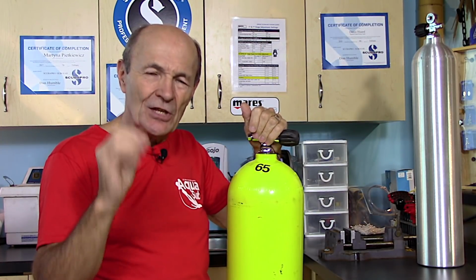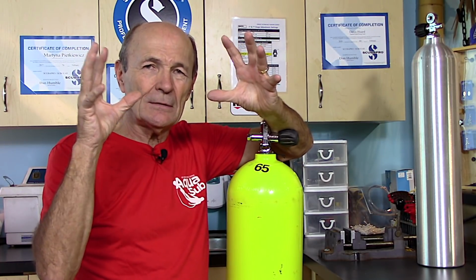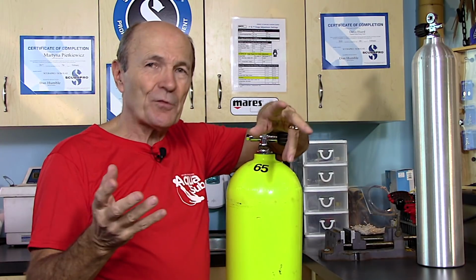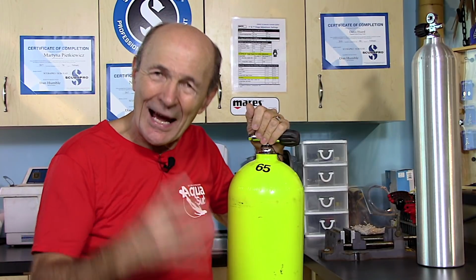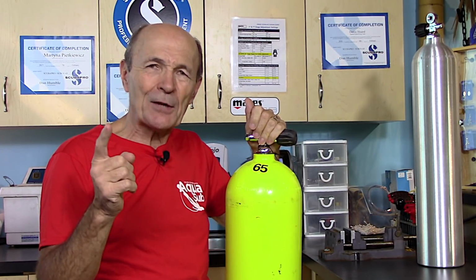If the tank does not have any elasticity from being stretched and shrunk too many times, if it's lost its elasticity, the next fill, it won't stretch. It'll blow up. That's right. It has to stretch. It's the nature of the process. That's what hydrostatic test does.